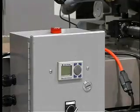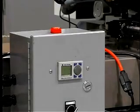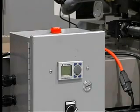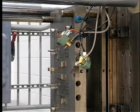The unit is now ready to run. The red light on top of the control box turns on as an indication that the mold release cylinder is almost empty. Mount the spray heads to the mold — you can use optional magnets which firmly hold the spray heads in place, or mount the heads permanently to the mold.